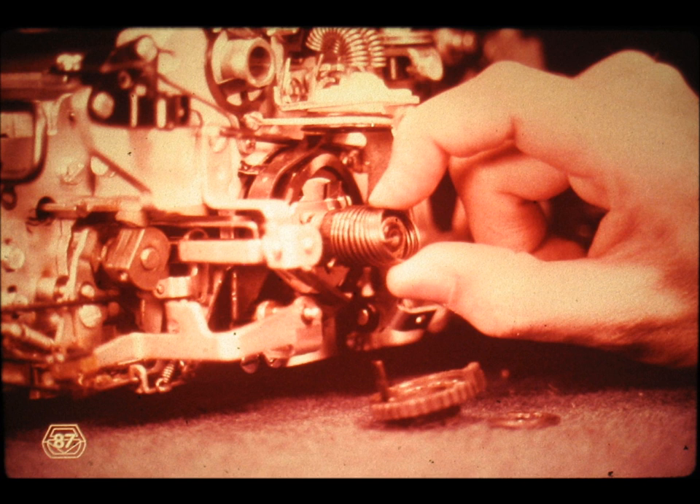Can you tell us why this is so? Stop your tape player while you formulate your answer. Your answer should have been somewhat like this: the clockwise, or top to the rear, rotation of the right end of the shift clutch spring, without also turning the left end, will tend to open the spring. Specifically, it will increase the internal diameter of the spring, thus making it easy to remove the spring from the shift arbor.